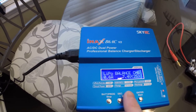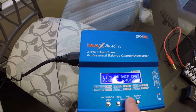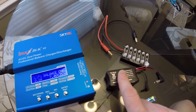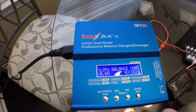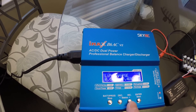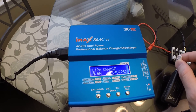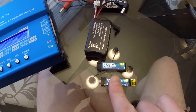On the screen you'll notice there are several different modes. There's a mode called balance charge, which we'll talk about when we're charging this battery right here, or other LiPos that have more than one cell, which we'll talk about cell count in a second. Then you have regular charge, which doesn't use this extra lead right here, so that's what we'll actually use to charge these smaller ones because these are single cell batteries.